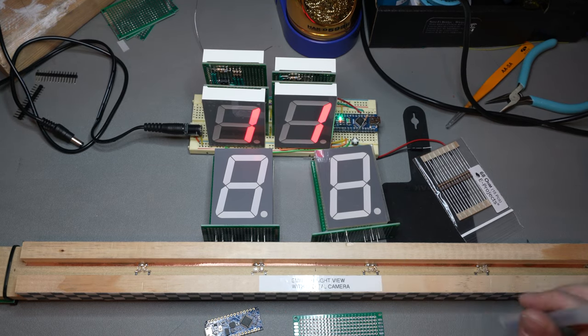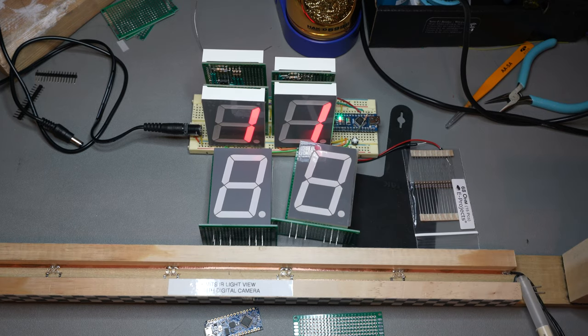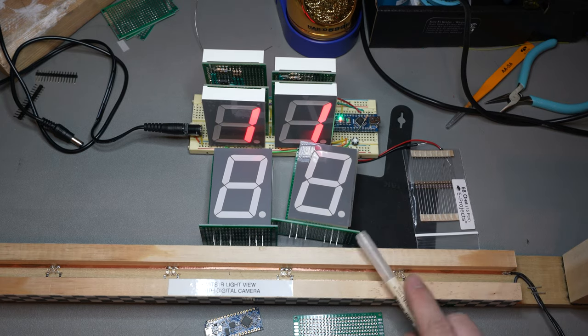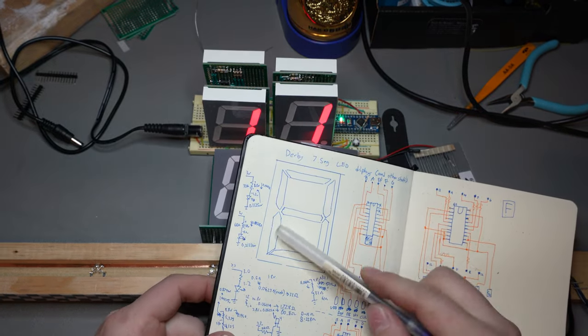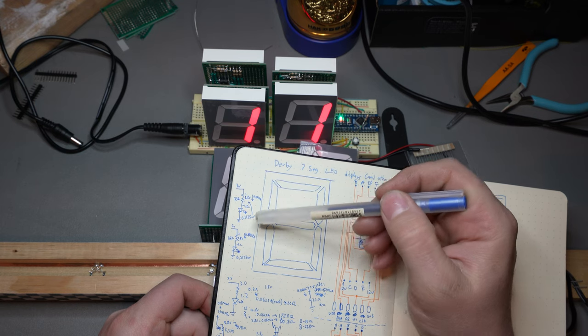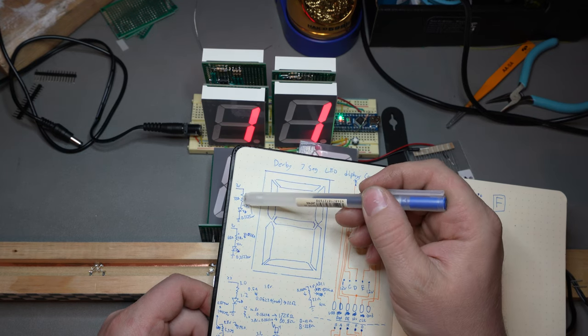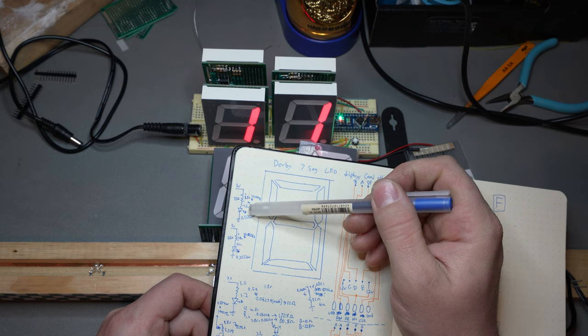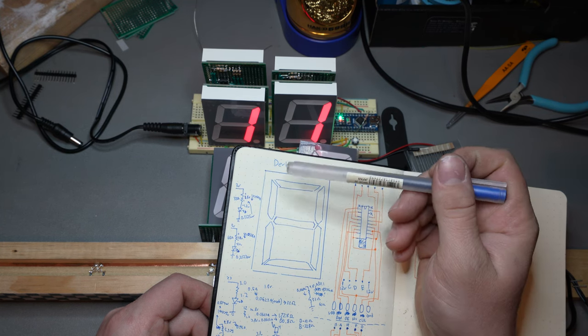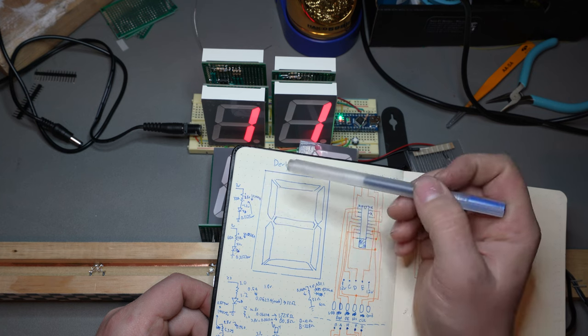In converting this to 5 volts, I have a few options. I can either, over here, put in one big resistor to limit the whole system. I can pull out their resistor and put in a new value, or I could maybe add in a value there. And just to give you a quick overview, currently in their system, we have 3 volts. We have a resistor and a diode, and the diode needs 1.2 volts, which means the resistor sees about 1.8 volts of a drop across it.